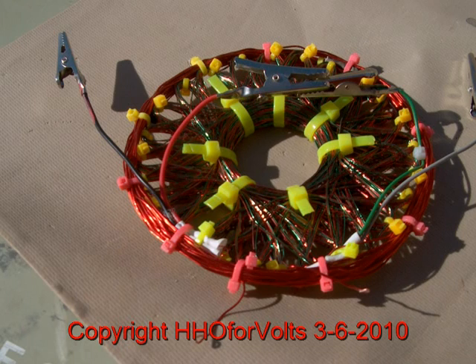What I did — and the reason for this — was that using the 1-inch N52 magnets, the distance to where I put them in the center, the distance to the start of the winding, was considerable. So I wanted to move that magnetic field farther in.